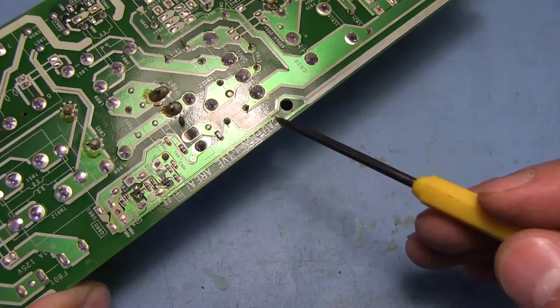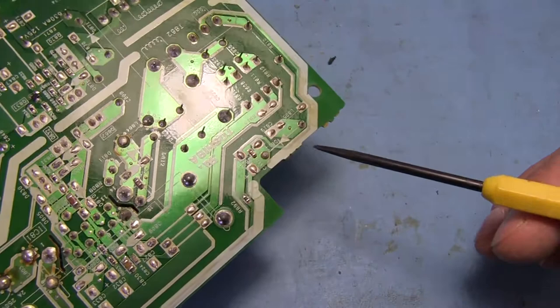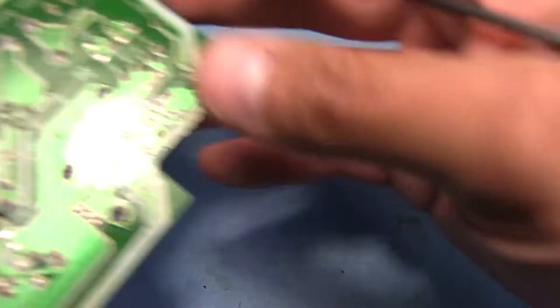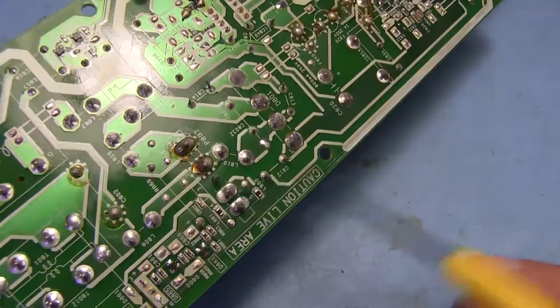It looks like there's another set here. Just doing a quick glance, it looks like this other set might be some low voltage stuff, or it's doing a power control for the lamp — maybe used as brightness control. This is kind of concentrated to just this area, with two small traces going off in this direction. There's a diode and some other stuff here, and it looks like that might be some low voltage supply stuff, because this is a transformer on the other side providing power to everything else. That's where we get our diode — rectification stuff — and a little electrolytic, and that supplies the low voltage stuff for the ballast.